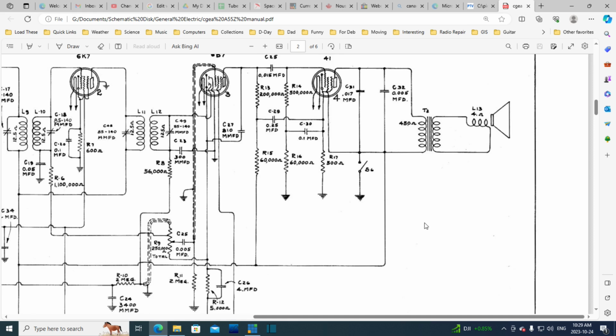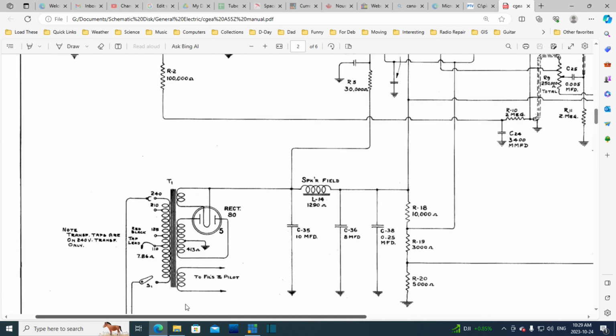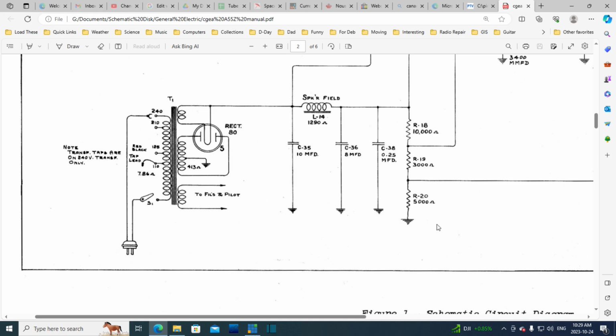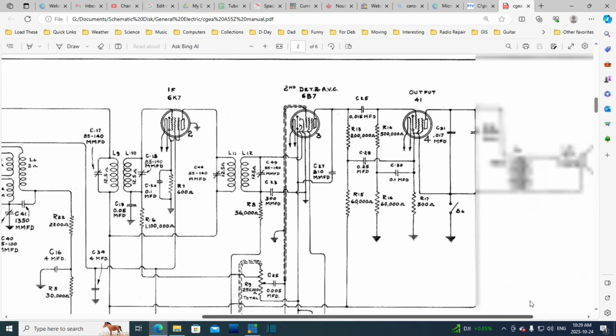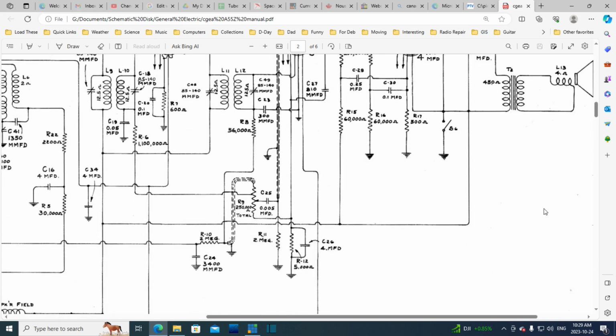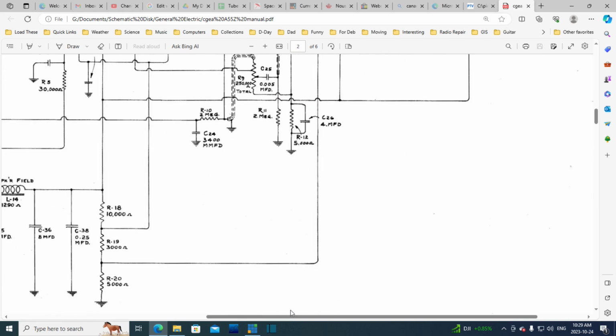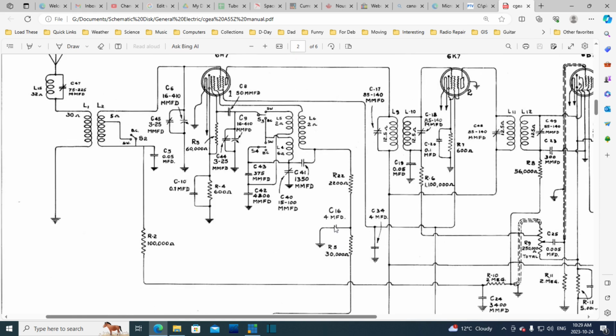That's good. That's it for looking at the schematic. Now, what are the implications of everything that I found here? What's the so what? The so what is learning how the chassis is dealt with, finding out if there's a negative supply here, which there is not, spotting things like the cathode resistors and bypass that's biasing the tubes, spotting things like there's no ground on the speaker out here, it's ungrounded, which may be important for later. What other interesting, or looking at how the power supply is taken care of, and wondering where are these?